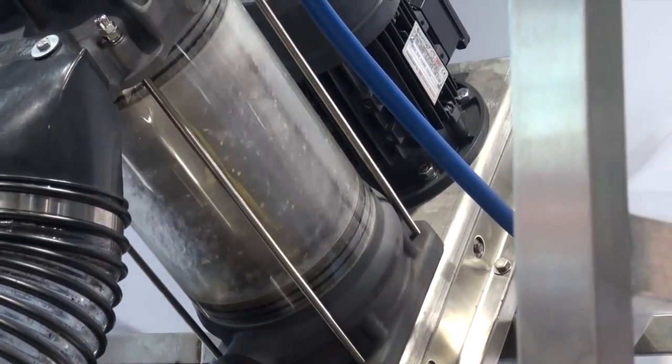Once the system has flushed itself out, it's going to go ahead and shut down. The last thing about our slow speed grinding system is how it can be set up. With Champion, we have a full design team, so we can actually remote our grinding system from our centrifuge, as shown in this video. But we can also have them closely related — what we call our closed-couple system — which is what's in the NRI booth right now. This gives us a lot of flexibility in design, and using wastewater from our dish machine allows for a one-feed system, meaning the wastewater transfers the food waste from the grinder to the centrifuge, and then we send it down the drain. This allows for a much less expensive installation, because we can use PVC pipes where local codes allow.